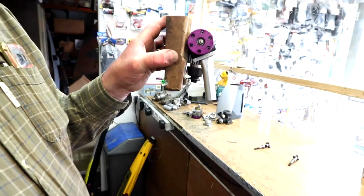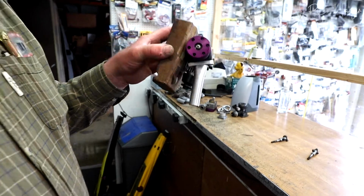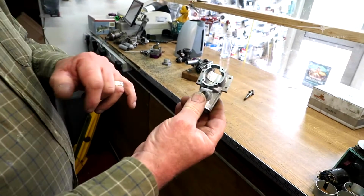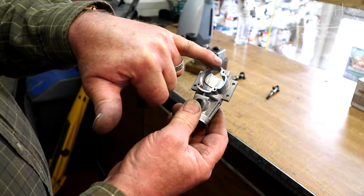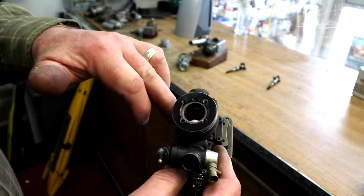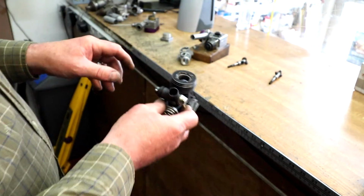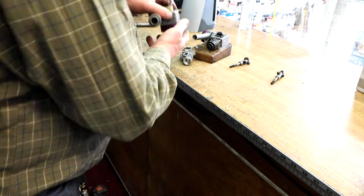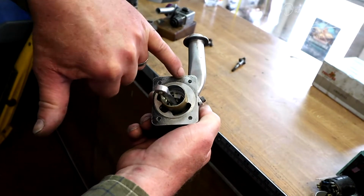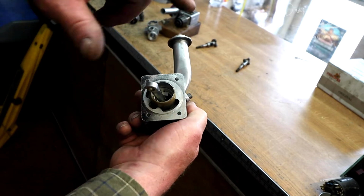Hang on, it's off centre. Yep. Because if you've got a side exhaust motor, you've got to put it over the top of the bearing and the back plate. If you've got a rear exhaust motor, you've got to pull either side, but also a port over the bearing. If you twist it, like this one is, this is the inside of the bigger motor in the boat, you can see that we'd have a bearing here, and ports here and ports there. So nothing gets in the way.